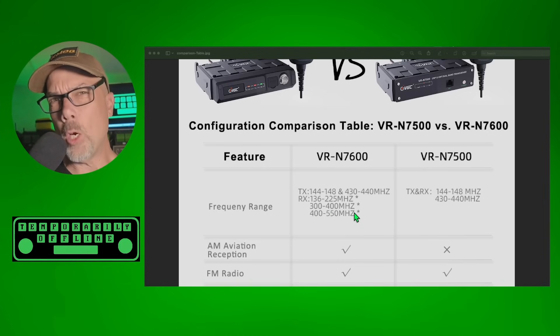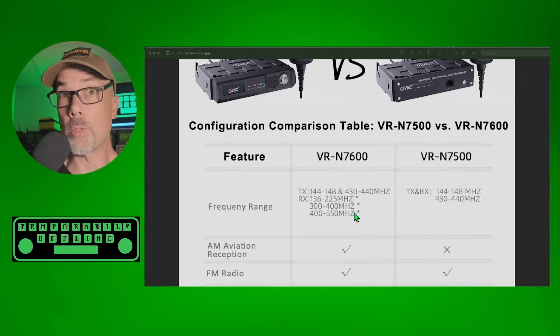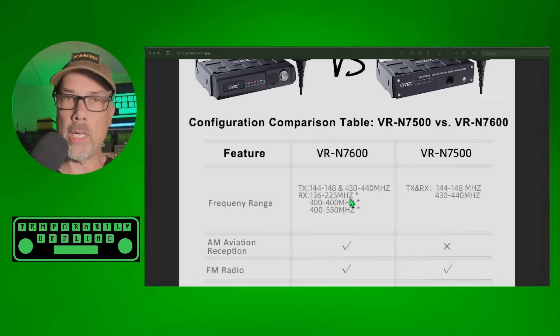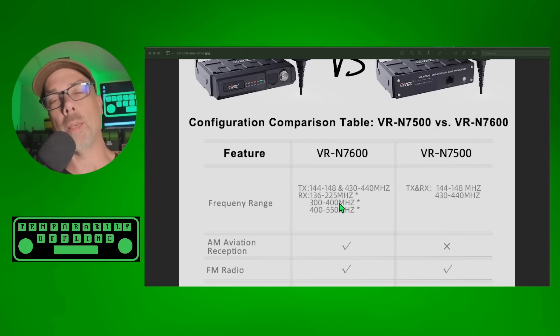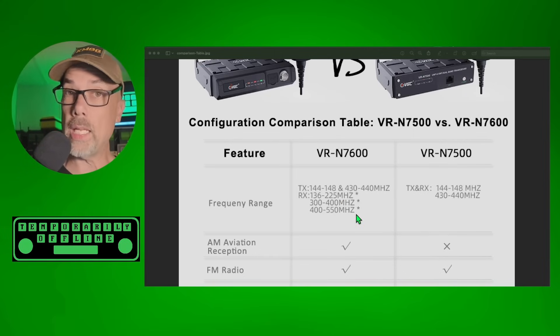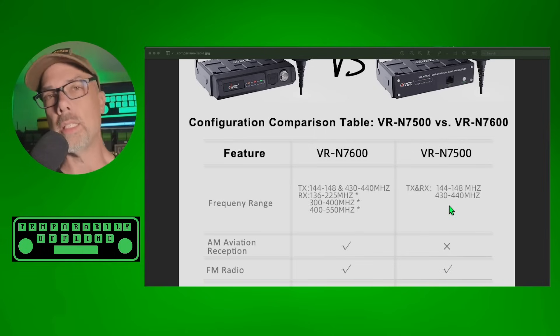The 7600 has a really easy open transmit mod — I'll show you that in a future video because I want to go forward and backward and do some testing on power output and so forth. Be sure you're subscribed to see that. In some cases it's legal, in some cases it's not. As a licensed ham radio operator, it is legal to take this radio and put it onto a ham frequency, though my license is on the line for making sure it doesn't produce any spurious emissions. If I was to modify this to go onto GMRS — which you can do — it is technically illegal to transmit on GMRS. But it's a straightforward, simple, easy unlock to get these extra frequencies.